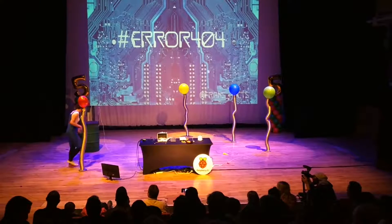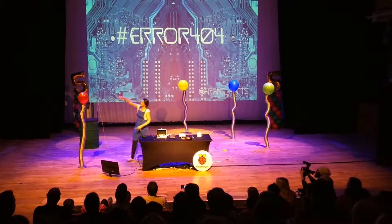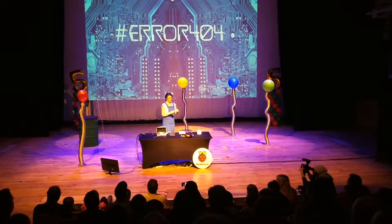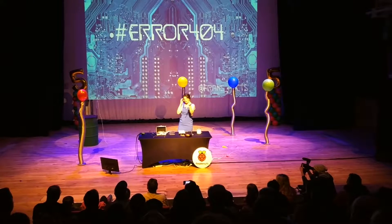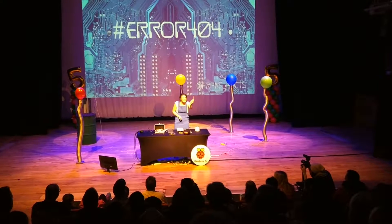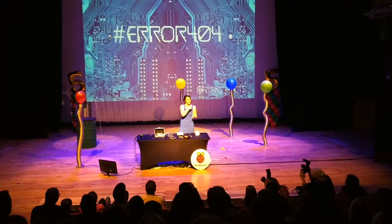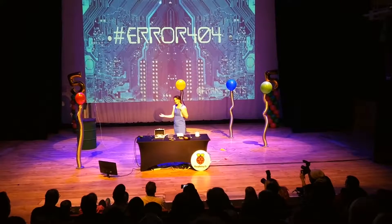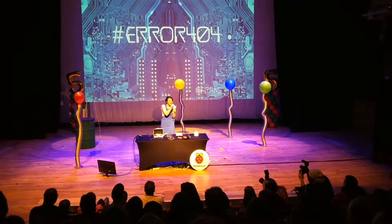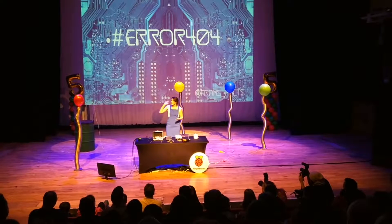To set this alight, I've got something a little bit special. I'm not going to use my candle on a stick — you can see it's got a little plaster on it. That is covering an electronic match. An electronic match has a little bit of microwire in it — microwire is high-resistance wire, so when you run electricity through it, the wire gets really hot. In there is a bunch of pyrotechnic material squashed next to it, so when the wire gets hot, the pyrotechnic lights and ignites anything next to it.